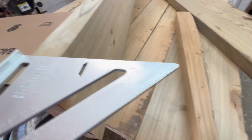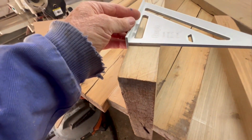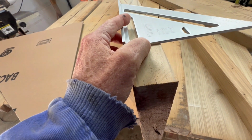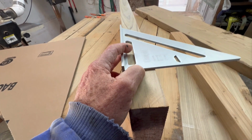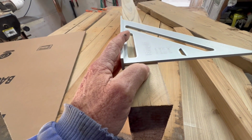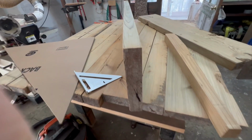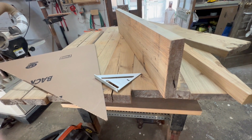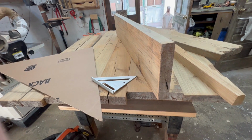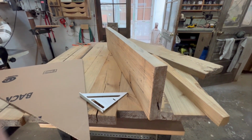And these are all just under 2 inches. So if I resaw an inch and then glue them together and then plane them, the top will be at maybe right at 7/8 of an inch. And the remainders will be just under 3/4, right about 3/4, and I can use all that material for the door fronts and the drawers and all the other stuff. So that's what I'm going to do. I am going to pick out the boards for the tops, two tops, and then rip them in half and then resaw them, and we'll move from there.